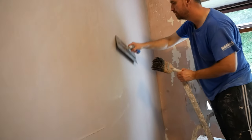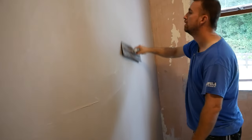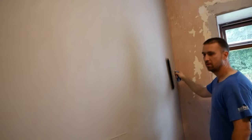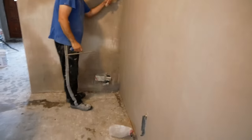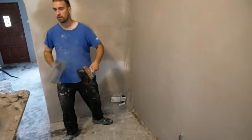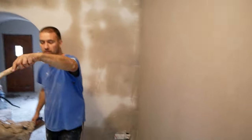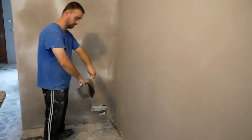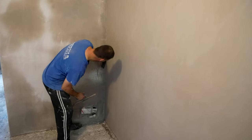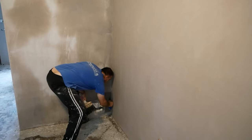If you need to fill in, but at this stage you really shouldn't have anything left. I'll just get this part of the trowel down for you too — it's really a trowel all the way down. As soon as you trowel, you want to add a little water. Same thing — fresh water guys, a little bit. Always keep them back to your trowel. There's a false spot there so we'll open that up.